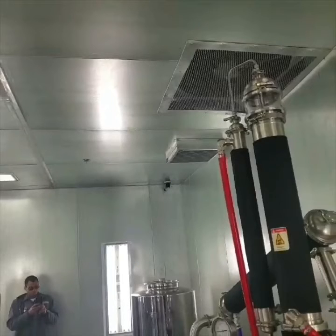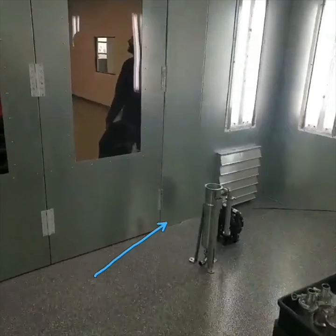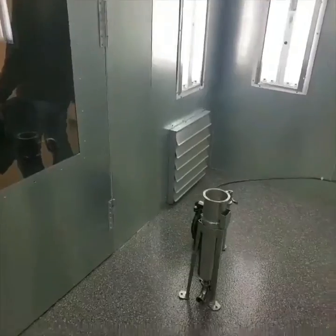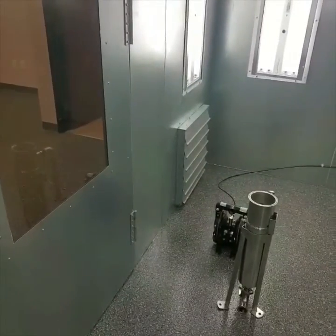Because these fans are removing air from this room and this room is essentially airtight, when the fan's turned on we have dampers that will allow outside air to come in to replace the air being removed. This is one of the dampers — there's also the same size damper on the other side. When the fan turns on and creates a suction inside the room, it pulls that damper open and allows air from the outside to enter in. You can see right now it's barely open, and you can see people on the outside. The noise levels on this are very quiet for this fan.